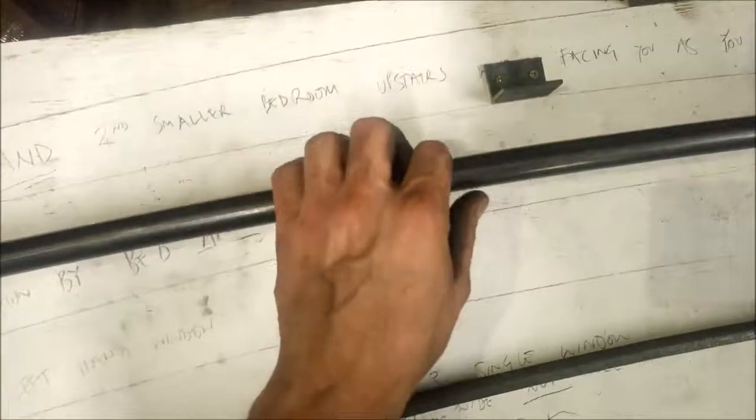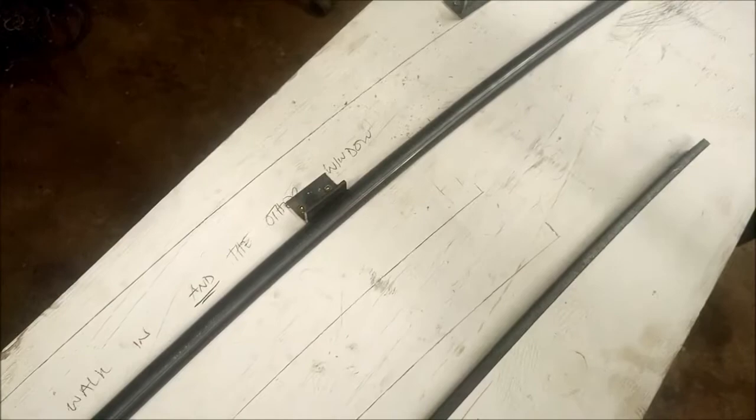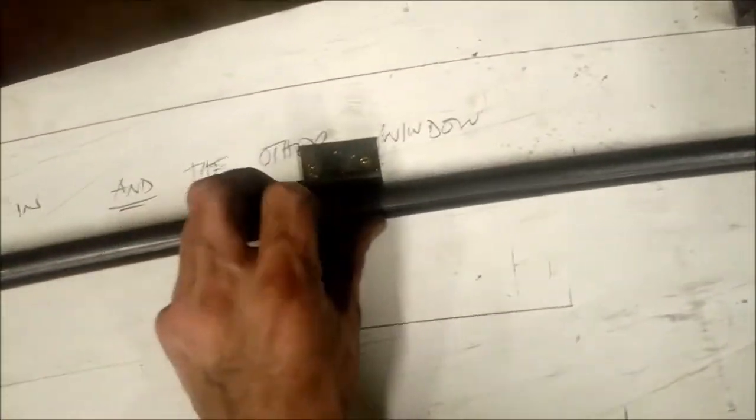Right, so I skipped a few repetitions of going back and forth because you'd just be bored as hell. So here's my line and here's my stoppers up against it. Because this produces a continuously even curve, I could push any part of it up against this. So now I'll push that up and it's hitting my fences, my stoppers at each point, so that tells me that it's all good, and I can move that along and reliably know that it's a good even curve.